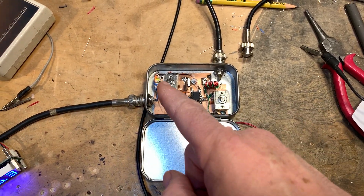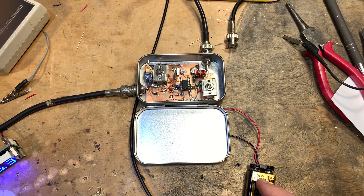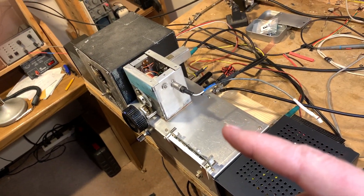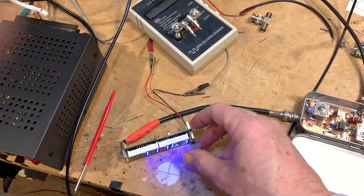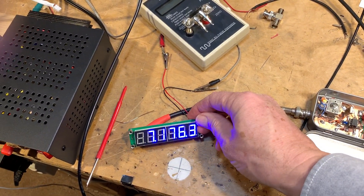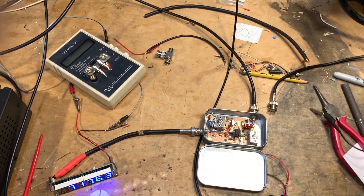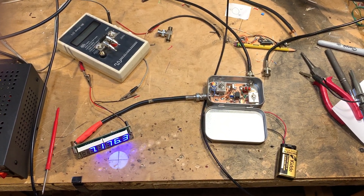And these are just some of the values I selected for the tuned circuits at the input and output of the NE602. Here are the tuned circuits, there's the NE602. Got it powered by a little 9-volt battery. This is the input from the VFO on the hodgepodge, and this is the output to the counter. Success! It's a good radio morning at N2CQR. 7.3, guys.